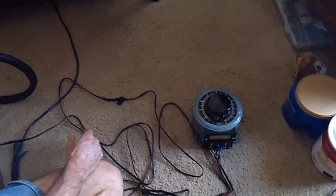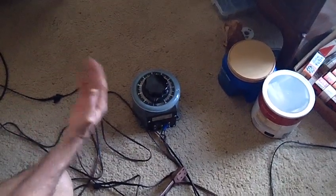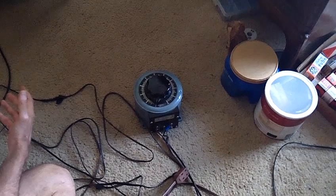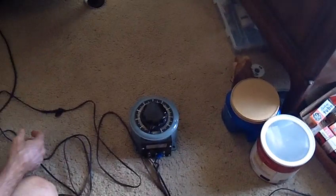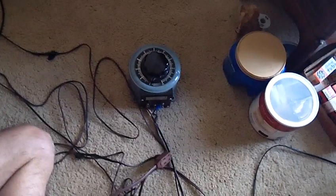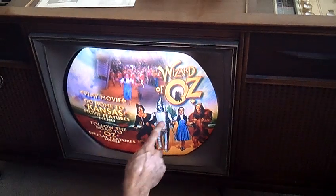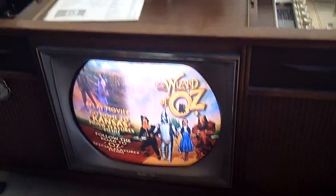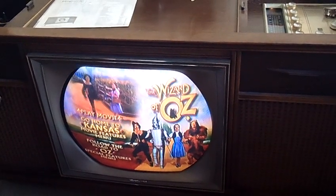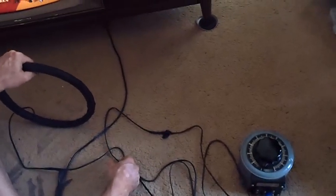I've got so many TVs around here that backing away slowly means I might just back into another TV, so instead I use my variac to slowly bring up the magnetic field. The alternating current makes an alternating magnetic field, and I slowly bring it down again. That process demagnetizes the aperture grille — or shadow mask — inside the CRT, which is a piece of metal with a lot of holes in it. Sometimes it gets magnetized and screws up the deflection, causing purity problems.